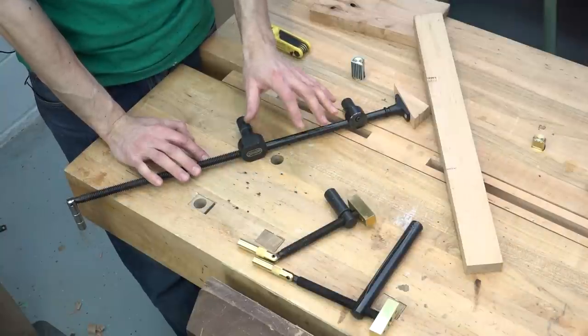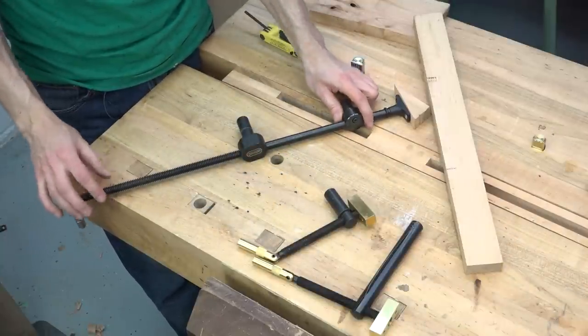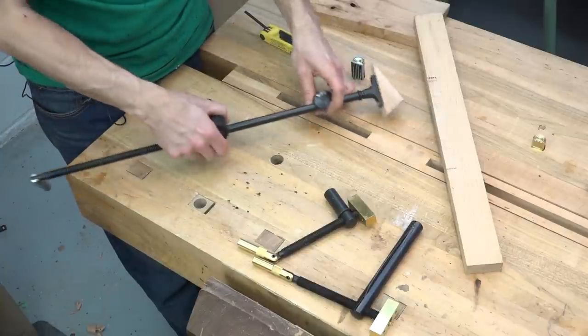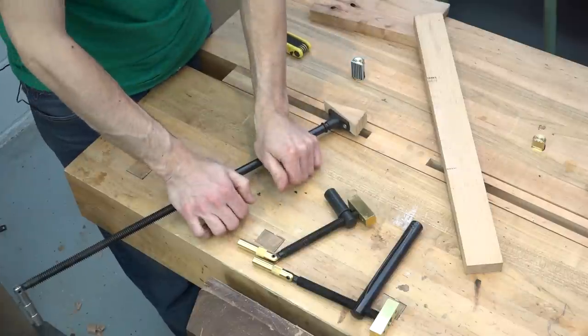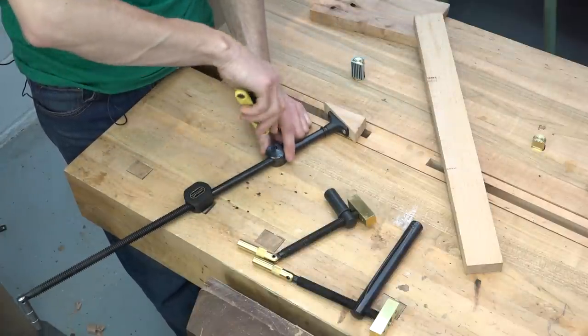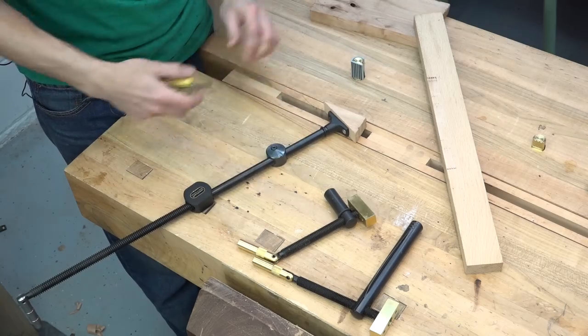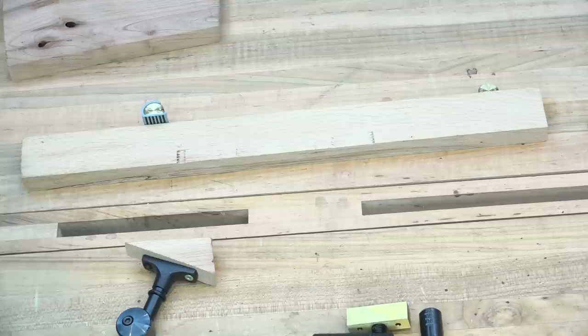The Surface Vise is a more robust version of the Wonder Dog and Pup. So it has this quick release mechanism and it has a lot more travel. So it can fit down into two dog holes. The fixed posts can be locked down so the vise can't lift out of the bench. You can butt your stock up against a dog or a couple of dogs, depending on your arrangement.